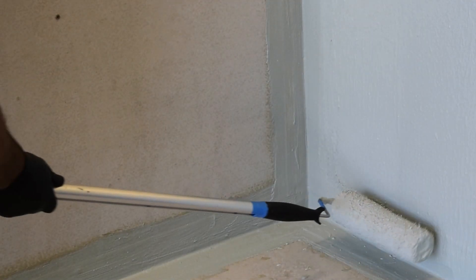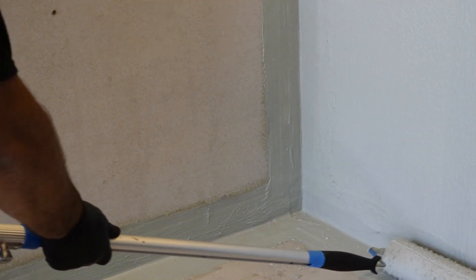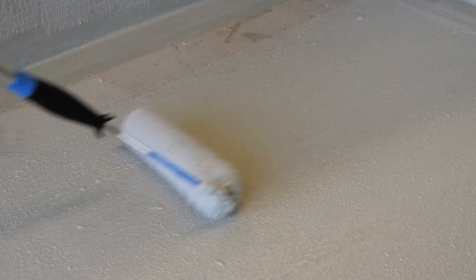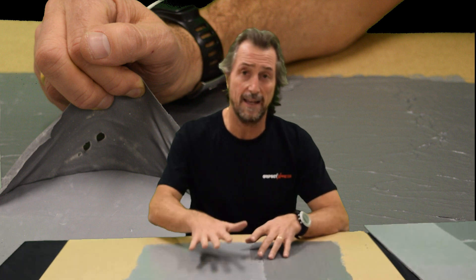In these situations in the marketplace where you're going with water-based membranes on the walls, if you want to successfully waterproof that area you need to follow that through right to the floor area. If there's a manufacturer out there that can guarantee a water-based system on top of this solvent-based PU, I'd like that to be brought to light because we'd like to know about it. We do see the ability to put a water-based system on an MS coating.